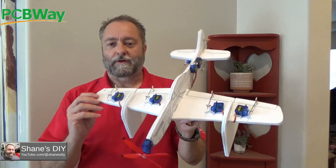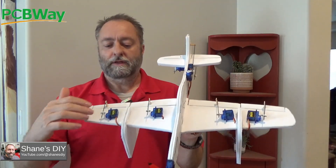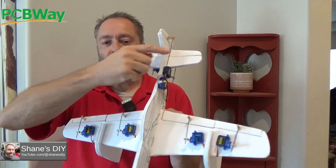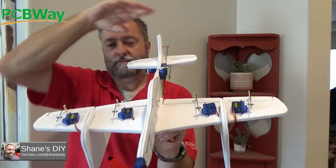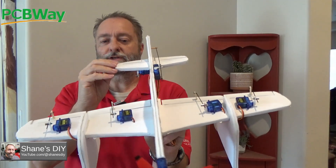This is a DIY channel. What I've been able to do with mine — because I wanted to be able to set up any possible scenario — is I actually put a separate servo on every single control surface, including the two elevators. Even though it's not a V-tail, this is going to let me simulate a V-tail model with my mixes, so I can make them move up and down individually.